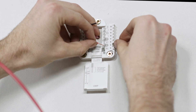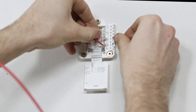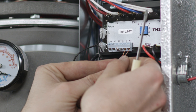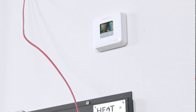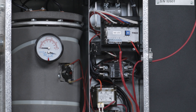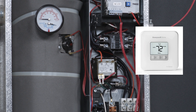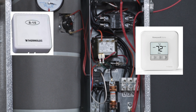Your qualified electrician will connect the R and W terminals on the thermostat to the W1 and C terminals on the boiler circuit board. Note, if using a different thermostat than what is typically supplied, refer to its user manual for proper installation. Check for leaks. Your boiler is now ready to have the main power connected by the electrician. All thermostats, zone controllers, and the optional outdoor sensor can now be connected.